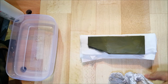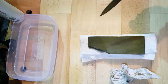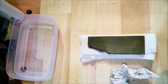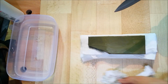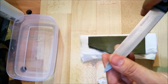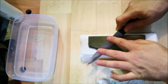As I told the guy that was asking me about my opinion about natural whetstones, I don't like them because they make slurry. I don't like slurry. As you can see, if you watch the other movie that I just told you about, in that one I've used a synthetic whetstone, and on the whetstone, as soon as I start sharpening, I see a black residue, which is actually filings from the knife. So I see some burr coming up here at the beginning of the knife, but not too much on this part. So I'll do another few passes trying to raise the burr.